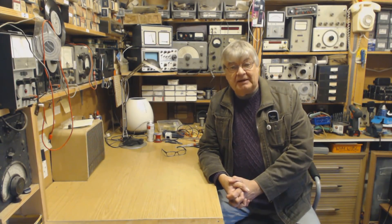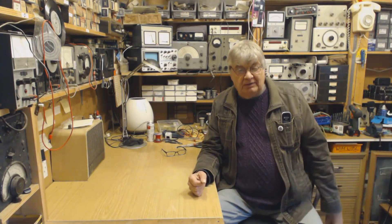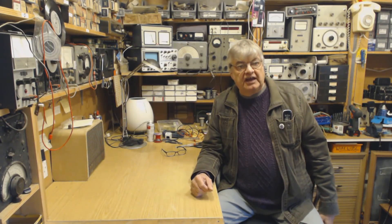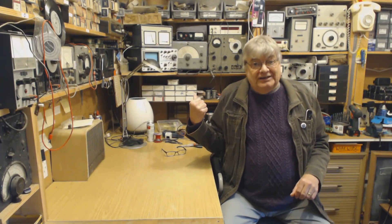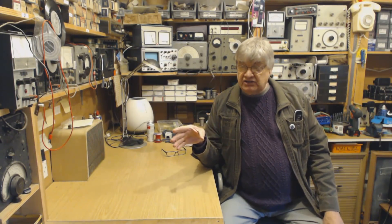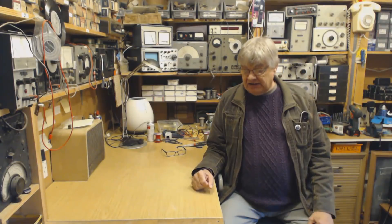Happy days. So there it is — there's not much else to say about it. It's well built, it's a good price. As I say, for under 200 quid you've got the whole setup. So if you're a newbie to amateur radio — I know there are a lot of people coming into the hobby — this sort of thing, if you've got a couple of hundred pounds, this will get you on the air with a decent signal, depending on the height of the aerial of course. The base of mine is only 14 feet above the ground. And from here, Worthing in West Sussex, UK, I'm getting into the Isle of Wight repeater — someone said to me on there, fully quietening, so that can't be bad. Hastings repeater's off at the moment. Worthing one's only half a mile away so I'm pretty strong into that one. Simplex, I've had a go on simplex channels, VHF and UHF, really good results. Good audio reports as well — several people have said good audio quality, sounds really nice. That's important.